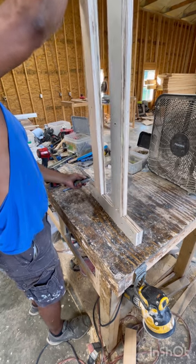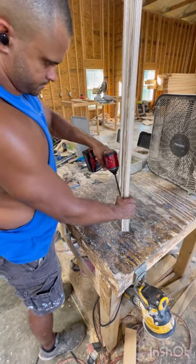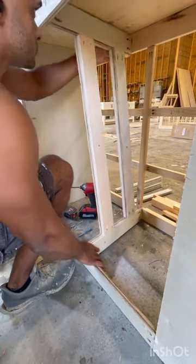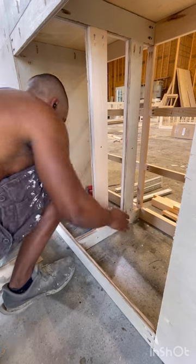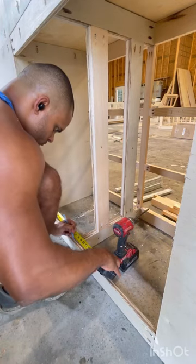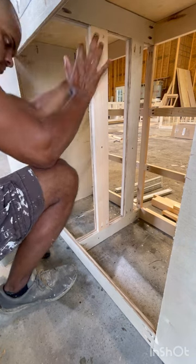I took a drawer slide and lined up where I wanted to put the holes so I could come back and make sure all my holes were in the right spot. Having a speed square and making sure everything's accurately measured is a huge plus. You only need to make one of these — more pocket holes, using inch-and-a-quarter torx screws to hold them together. Then I attach those, line them up perfectly — it should be exactly the same width as the front face piece, inch and a half.